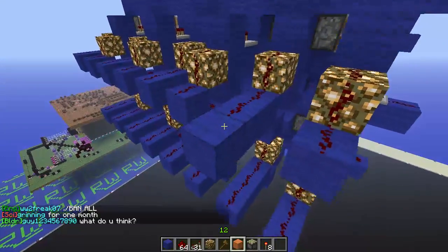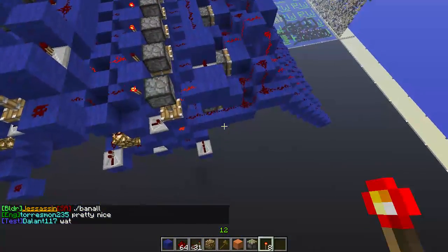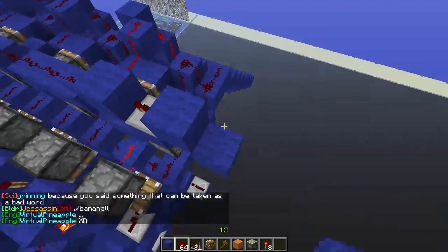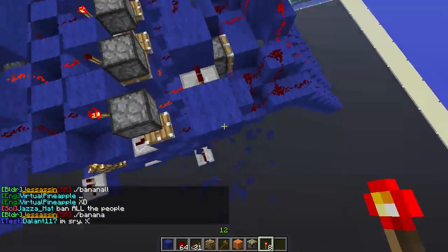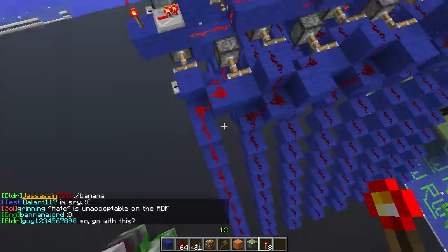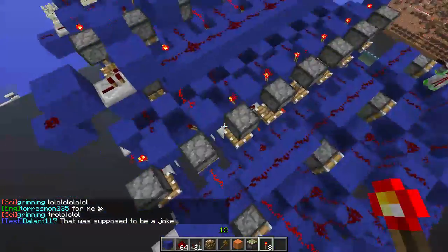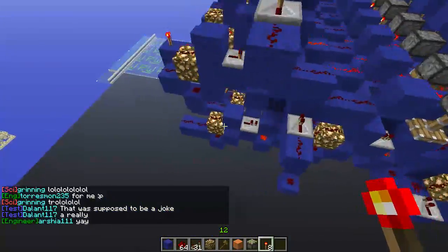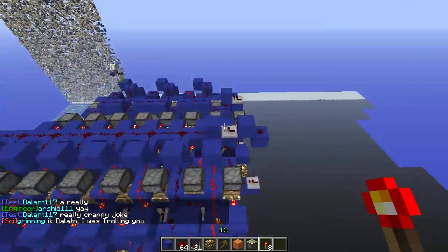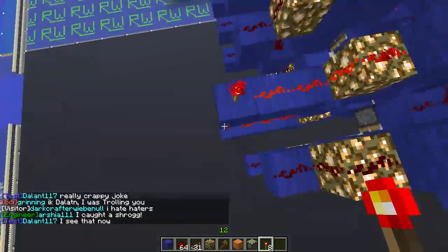I'll show you guys exactly how that works right now. Normally that value would go through there, and then if you turn this on, it basically just sends the value down the bus to the right. You don't need to do two of them because, to shift left, you would just do A plus A — or 2A. If you add a number to itself, it shifts it to the left one. Very simple.